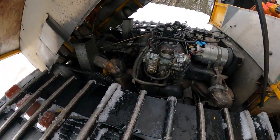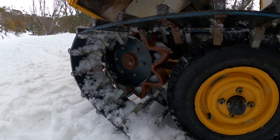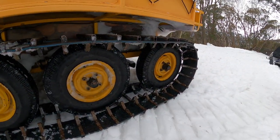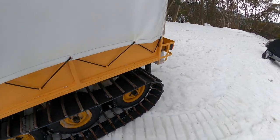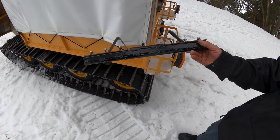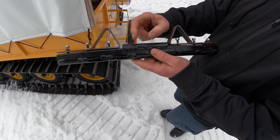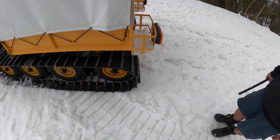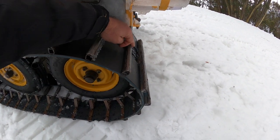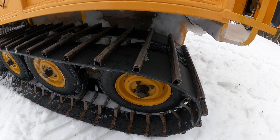So then they've just gone chains to the front sprocket there, the drive sprockets. And then obviously that drives the tracks, and then these would just be off a trailer? The track bars — they're an interesting sort of design. So those are the track bars. They do wear out, and what tends to happen when there's low snow on the roads, these center parts actually cop the hiding and they snap out. And then you've got to just basically re-weld them — this is your sacrificial piece. You just take that bit off and replace them, or just make new ones and swap them out.